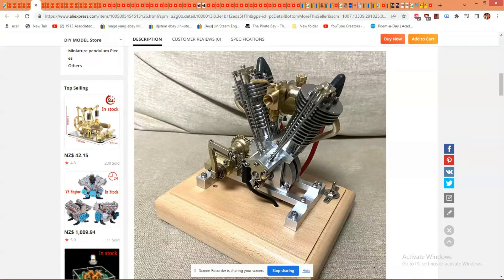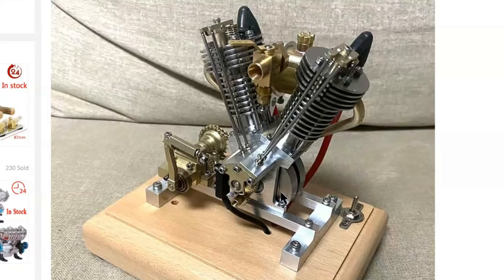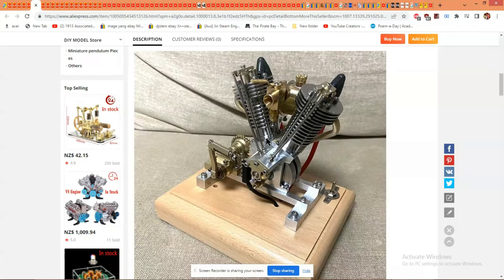Let's have a look at what we can see here. Everything's exposed on this engine — from the valves to the crank. There's sort of no crankcase, all the gearing, and the optical ignition collector there. This is a great idea. The one thing about Microcosm's V-twins that makes me nervous is that it's difficult to get to any of these parts to lubricate. So I have high hopes that this will be a very easy model to keep lubricated. You guys know I believe in lots and lots of oil on these models, because the metals are usually not as hard as they might be. Another thing you'd notice is the extensive use of ball bearings in the construction, not the brass casting that we've become used to, although the color of this looks like aluminium to me.